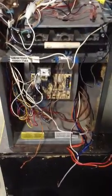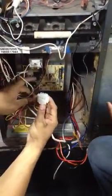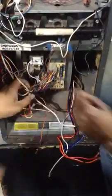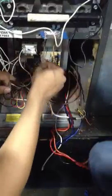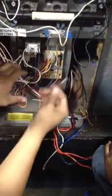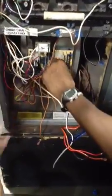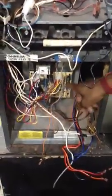Now that we have 110 volts running to our inducer and igniter, we're going to come back down to the board area. You have another pin connection — the 24-volt pin connection — and it only goes in one way, so it can only go in correctly. Put that in so now we have our 24 volts ready. Take your 24-volt wires off your pin connection and put them back on your transformer — one goes to each side, that's how you get your 24-volt hot and your 24-volt common. All your components — your limits, your gas valve — get their 24 volts from this pin connection.